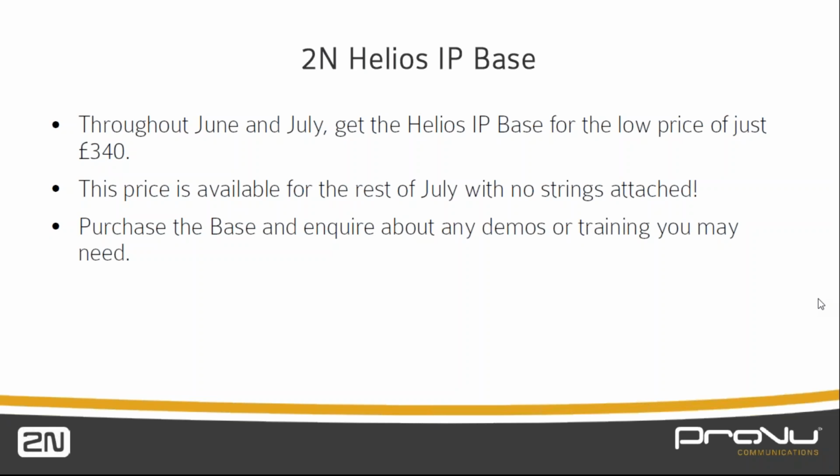I can see we've had a question from Louis about whether it can integrate with your customer CCTV system. Do you want to... So the standard video that comes out of the system is based on SIP. So it integrates into a telephony system, and you'll get full video streaming as part of the call. But as well as that, there is the JPEG streaming that's built into it.